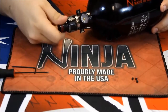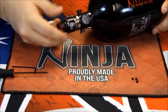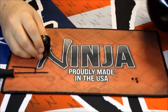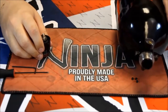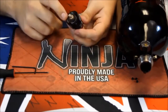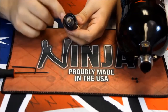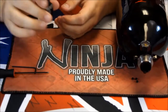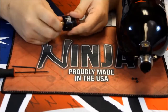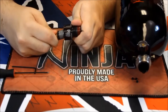So with those bonnet set screws removed, we can actually just remove the bonnet here. And as you can see, it comes in 2 pieces there. We'll set the actual tank body to the side here for a second. Side here, you will see your spring stack with the piston. This will stick in your bonnet most of the time. If you do have any difficulty removing this, you don't need any sort of tool. You can just wiggle it out. It's just the O-rings keeping the seal there.